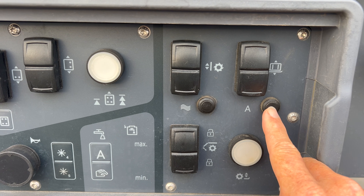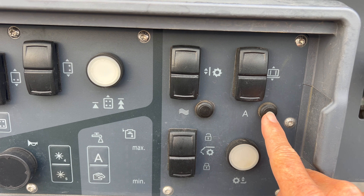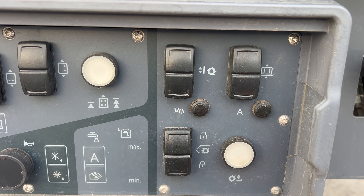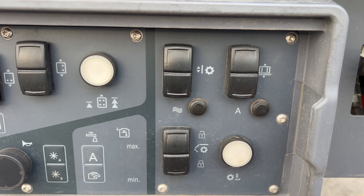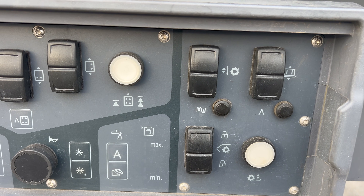Automatic side plate is so when you're running the rabbit foot or slope on this side, it will prevent the side plate from sinking in the material — like say you're pulverizing or you're in soft dirt or something like that. It'll constantly hop the side plate up and down to keep it from sinking in the material.